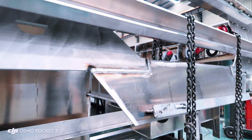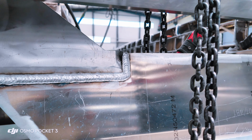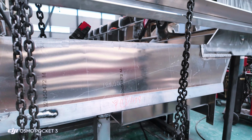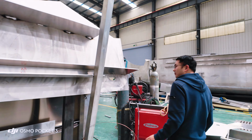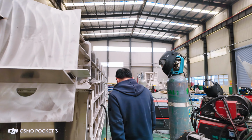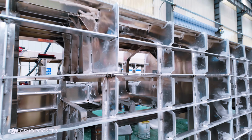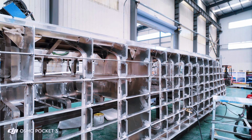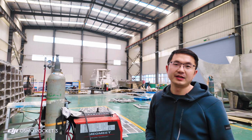So all the welding in certain positions will also be tested by the surveyors to make sure it's very qualified. Now the stage is, after we finish the survey for the keel sand, we pulled all the bottom plate at this stage. So for the next phase of the survey, I'll make another video to show the progress.